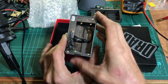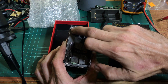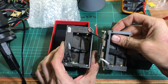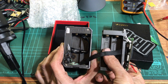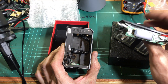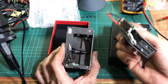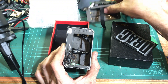So it's pretty easy to tell it's had a big failure. This is the circuit board running along this side here. I don't have another drag to compare, but I do have an Alpha One board assembly and it's really, really similar — it's a slightly different configuration, but it's a gene board. This is a 200-watt; the drag is a 157. Shouldn't matter a great deal — they're going to be really similar. So I can kind of tell what wiring configuration they're using and how they've constructed the sled, so I've got something to reference off there at least.